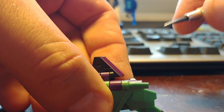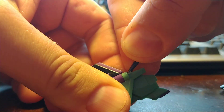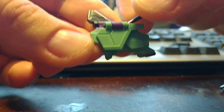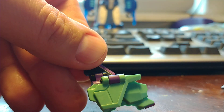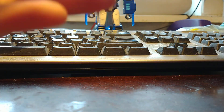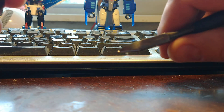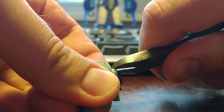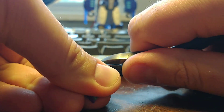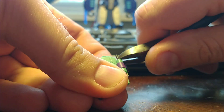No sense in both of us being battle damaged. So what you do is once you've drilled this hole out, you're then going to want to take a pin punch and press until you get just a little bit of a head right there. Grab a hold of it — it helps if you have a pair of snips rather than needle nose. Grab it and use the leverage, just like pulling a nail out with a hammer. There we go — it's coming out now. Just like that.